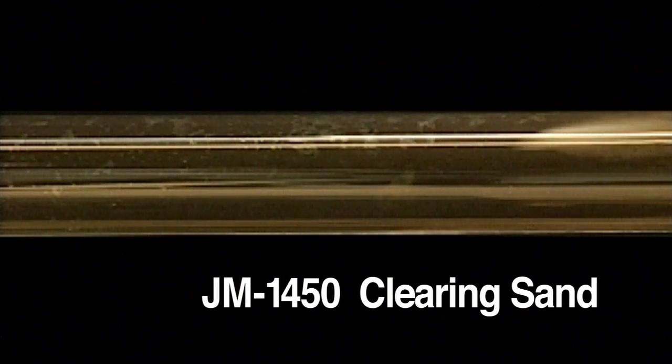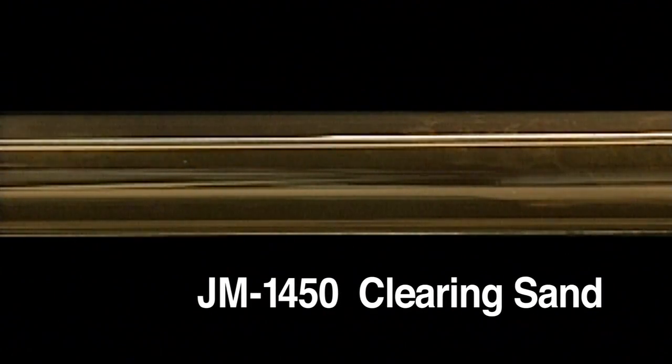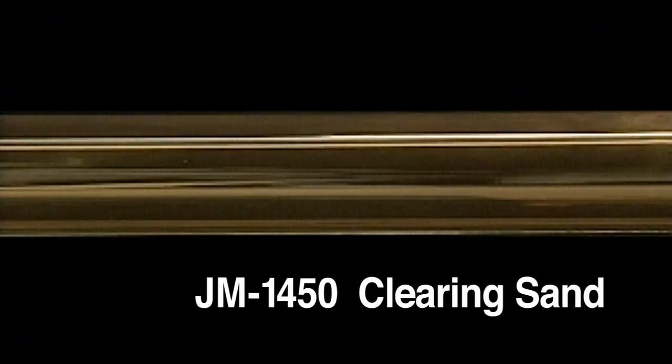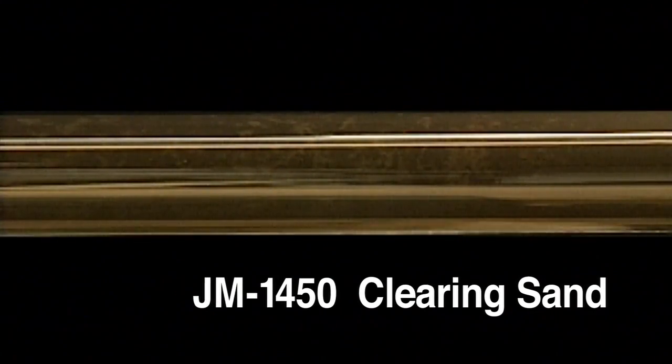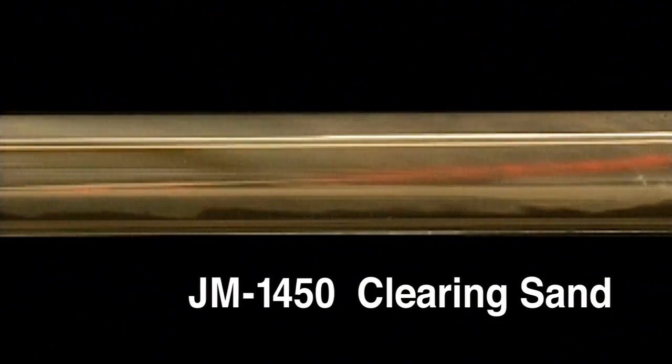Of course, nothing beats a cable machine for cutting tree roots and other difficult stoppages. But for clearing soft stoppages and ice from lines, General's jets are the ideal tools. We use both. Both have their applications. But basically, if you're going to be dealing with grease, fast food industry and retail stores like that, the jetter is the only thing really.